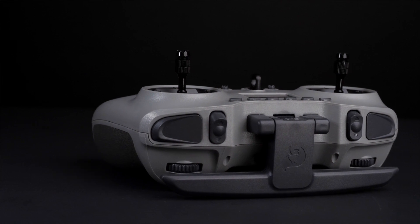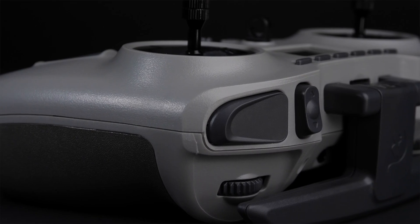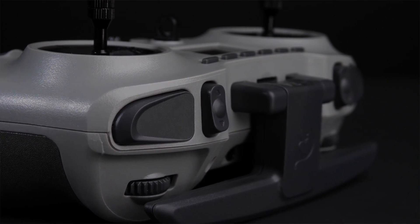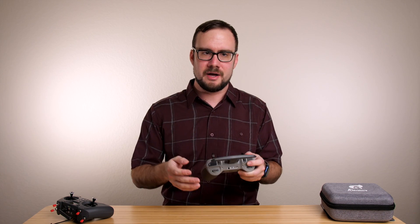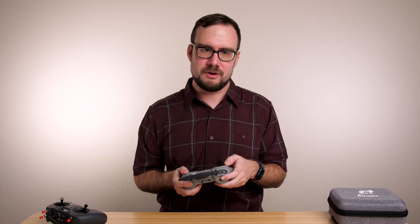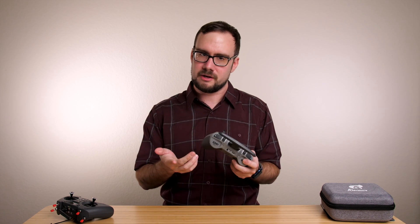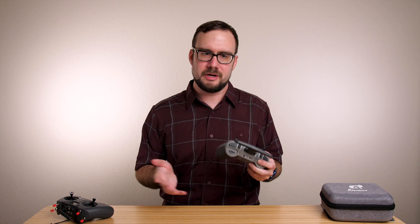Moving on to other controls, this is where the T Pro starts to differ from other radios. We've got these momentary clicky buttons on the top shoulders of the radio and I actually really like the way these work. They're positioned well, easy to press, and don't have much travel so you can click them very quickly. But the obvious question is how you'd actually use these to arm the radio — normally the arm switch would be a toggle that stays high to keep the flight controller armed, but these are momentary switches that click on and off when pressed and released. It turns out you can fix this pretty easily with some configuration in EdgeTX. I ended up setting mine up so I press both buttons at the same time to arm, then release and it stays armed. To disarm, I press a single button, which is nice and fast since I always want to disarm quickly. That wasn't too hard to set up and I'll link a video below showing how to do it.